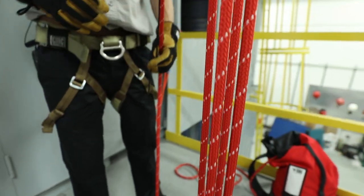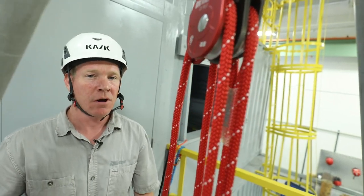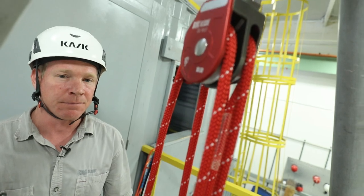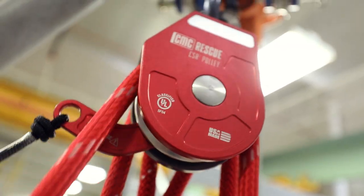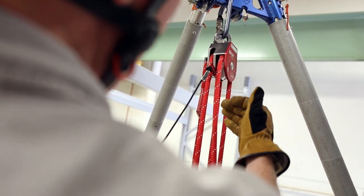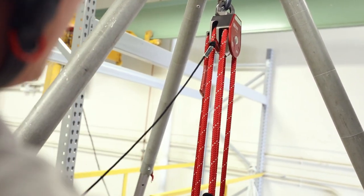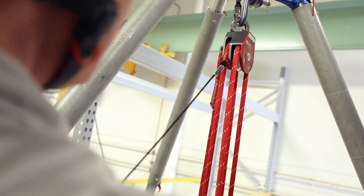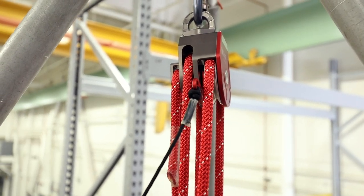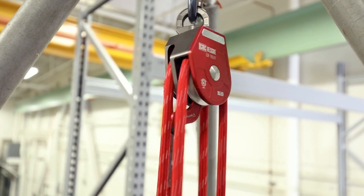Each of the CSR2 pulley systems comes with 200 feet of rope, giving you 50 feet of draw or extension with the 4-to-1 system. It's very responsive — no resetting or dropping to let it settle into the lock. It locks immediately, comes to a stop; just let go of the release cord and it stops instantly.